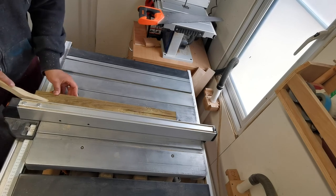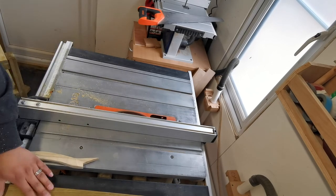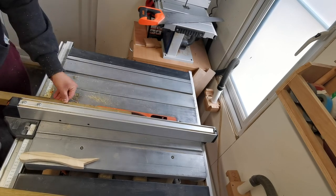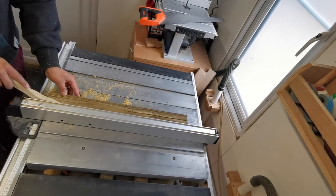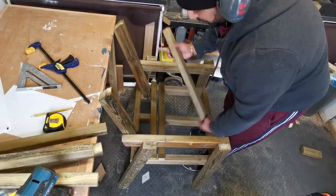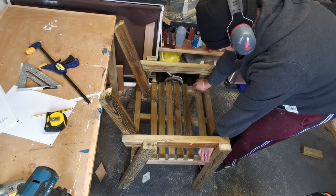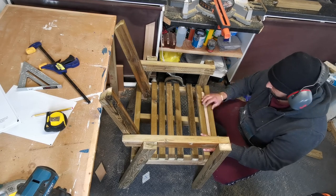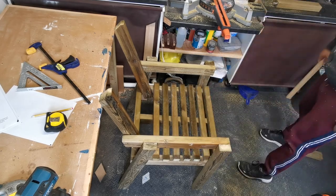Using the table saw, I'm going to cut some slats — basically trimming the 2x4s in half. I went for slightly thicker slats because I wanted them to be really solid and long lasting. If you wanted to save a bit of money and time, you could buy pre-trimmed slats or do them a little bit thinner. What I did first before screwing anything down is just do a dry run to see how many I needed and whether they all fit with the correct spacing. I used a piece of wood to give me consistent spacing throughout, just to make sure there were enough slats for the entire seat.